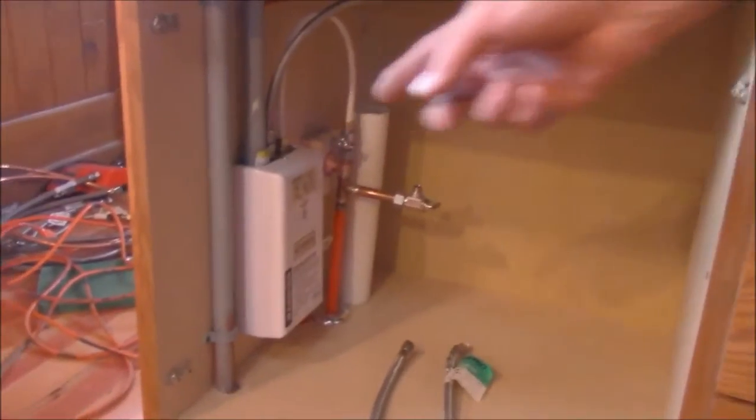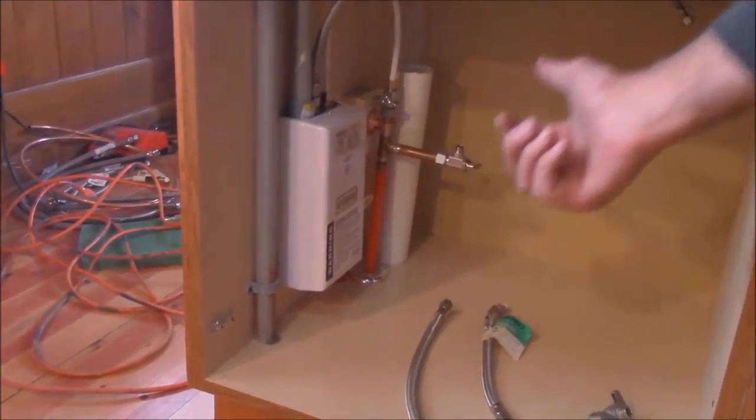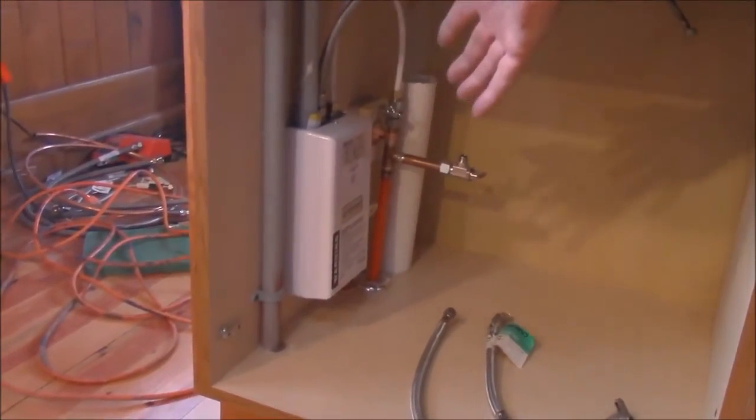The tank down here stores hot water, so it's using a little bit of electricity all the time maintaining hot water. But it needs less electricity — it's on a 15-amp, 110-volt circuit — so it can take its time making it and it's storing it, which means it uses less electricity. Our other unit doesn't store anything; the water comes in, it goes through a set of coils, the flow switch kicks on, and it feeds the sink. So there's absolutely no storage there — that unit wastes zero electricity when we're not using it, it's not drawing any power.